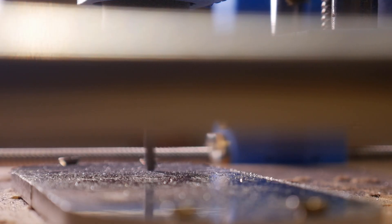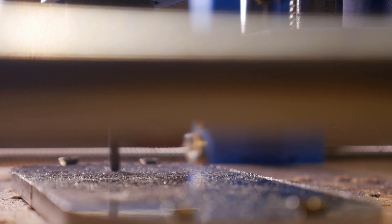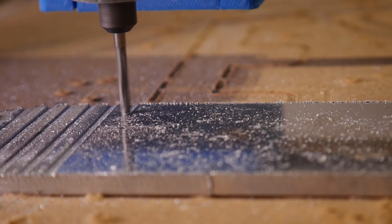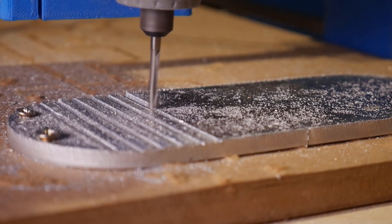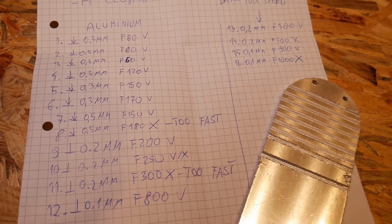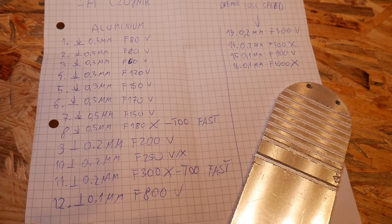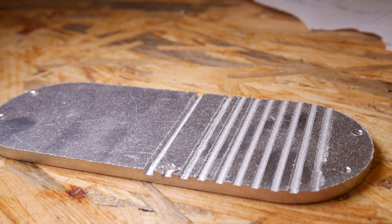Be careful, because you can break a bit or destroy your machine. To make those single passes, I simply controlled my machine through CNCjs with G-code commands. After a few passes, I found that 0.1mm deep and 800mm per minute feed rate seem to work fine. If you are using the same setup as I do, you can probably use the same feed, but try to experiment — maybe you will find a better setting than I did. Once we figure out feed rate and depth of cut, we can go to Fusion 360.